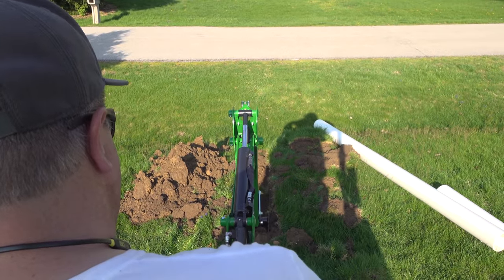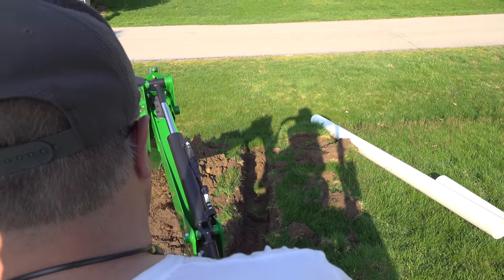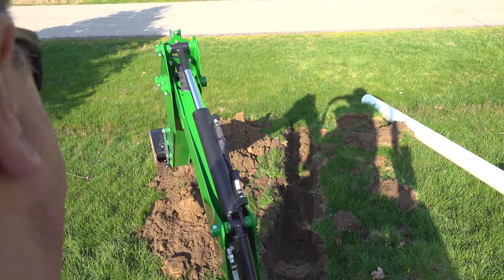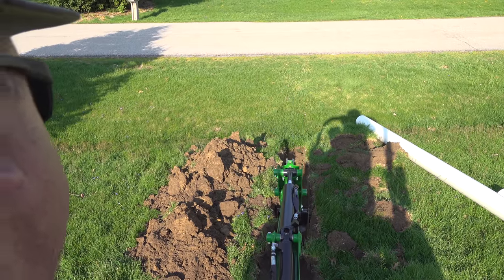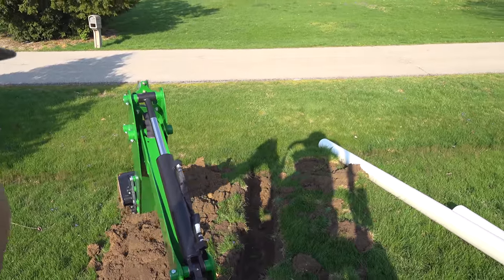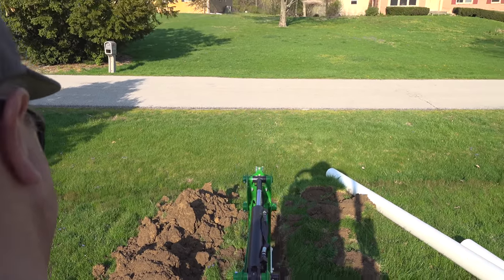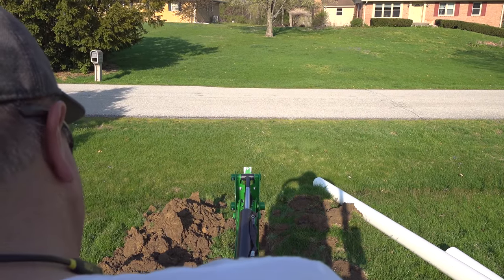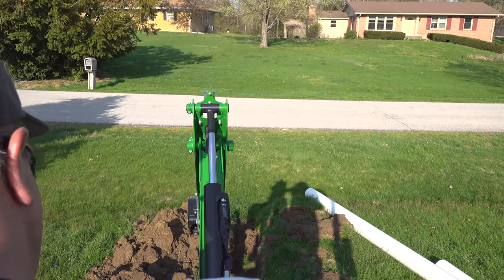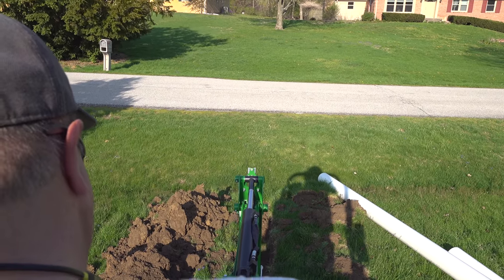A lot of people are probably going to ask why I chose this machine. Well, there's a couple of reasons. Right at the top was, it was a brand new machine and I wanted to try it. I thought for this operation — since we needed a trench, needed to fill it in, and we're in someone's yard trying to do minimal damage — it might be a good place to use this tractor instead of Casey. Now if I were by myself, I would use Casey because it's easiest to have Christy help move the tractor forward. Whereas with Casey, you can control all your movements from one position, which makes your overall digging speed a lot faster with a mini excavator than with any sort of backhoe.